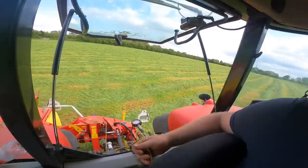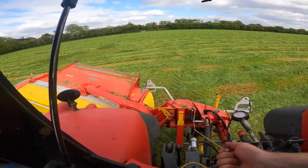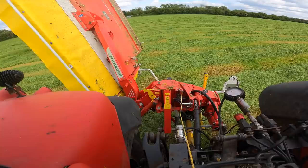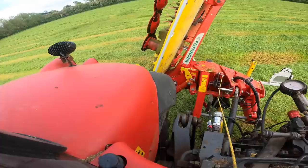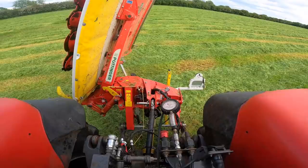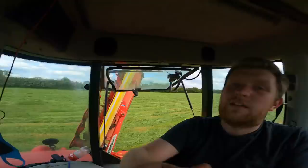I suppose just on the mower, what I do now, I pull this, you can see it pulls in a valve as well. So then when I pull my lever, it lifts up. And up and up. And then I let go. And then when I let go, it changes to this ram here on the arm, so that you can adjust the amount of weight that's on your lift arms, and it's fierce handy when your mower is out and you're getting her set up, because you can transfer a lot of weight onto the left hand side. Well, look, I've never used one of these mowers before side mounted, so I don't know how much to expect, but in my mind, from what people are saying, how they're feeling very heavy, I don't think it's that bad. But anyways, talk a bit more about that when I get mowing.